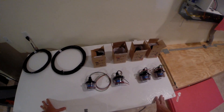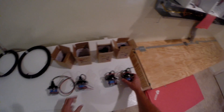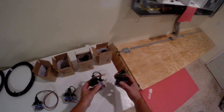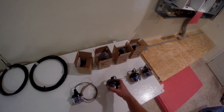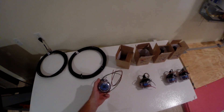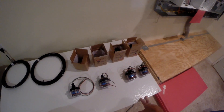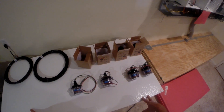I got four of the Midnight Solar Surge Protectors. Three of them are the 300s and this is a 115. I got these two for the combiner boxes. This one will go on the AC supply side. I'm going to get another one for the AC output. And this one will go to protect the DC side to the inverters. Probably going to get another two for my main input supply power boxes to the house.